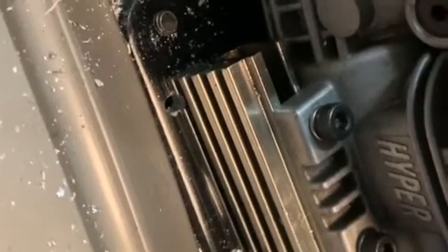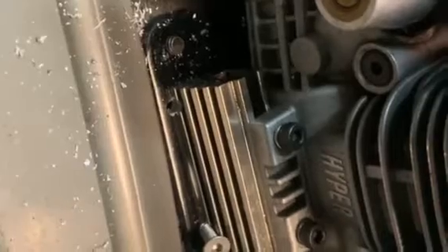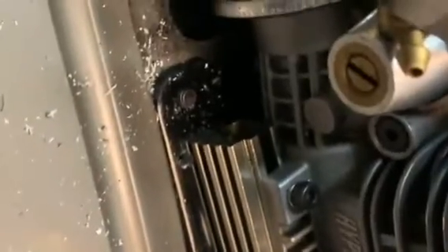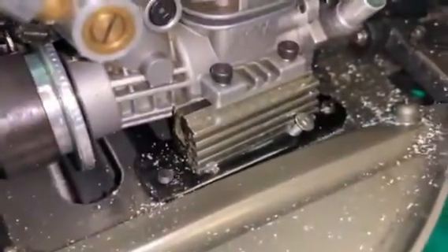That's very tight — probably way too tight. A 2.5mm hole seems to be too tight for a 3mm screw, so I'm not going to put a nut on the other side. We can either just use a short screw and leave it there and hope that it stays. Another option is to make up a metal plate that goes around and use a longer screw with it, but you'd probably have to glue it into place and drill the holes from underneath, which would be really hard.